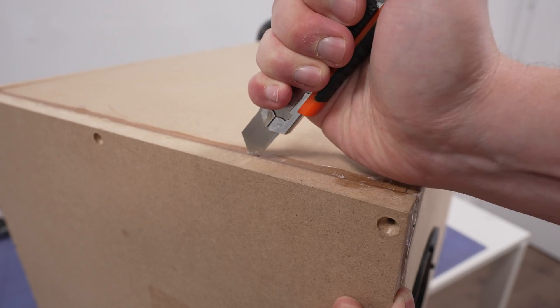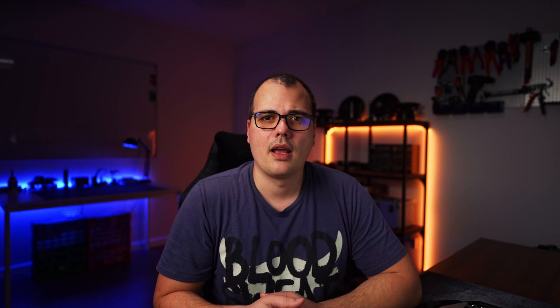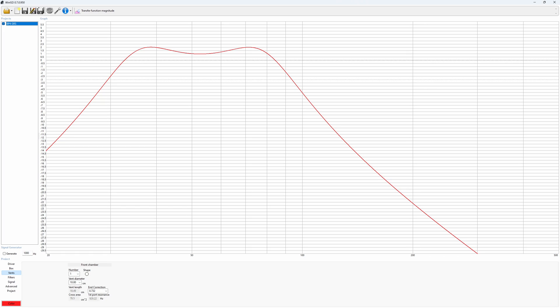I'm going to get some backlash for this, but I like to do it this way because it works. With a bit of hassle I can get the side panel off and access the speaker if I want to — just stick a blade between the panels and cut the silicone. The silicone seals well and keeps the panel in place like regular glue. The only issue is that after a few years the silicone deteriorates and you probably need to reapply. Just be aware that if you use wood glue and need to access the speaker, you need to destroy the box. Now it's time for the port. The length of the port is calculated to be 18 centimeters, but the beauty of circular ports is that we can tune it after the box is finished — take it out, cut it to size and try again.